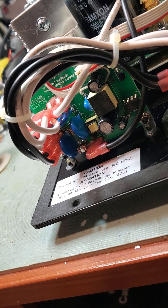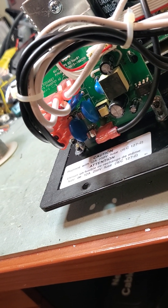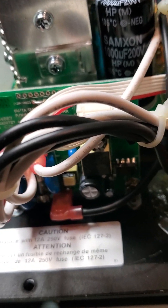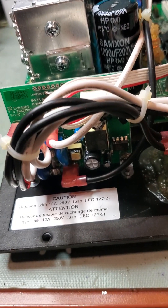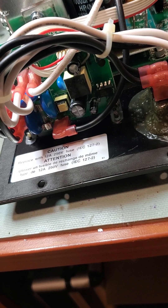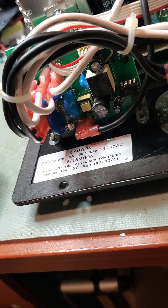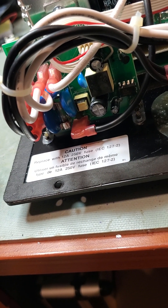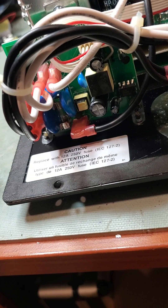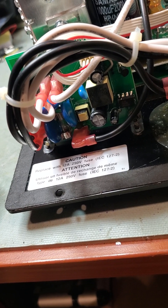I'm not exactly sure why — looking at the datasheet it should work with the 220 that was there before. But anyways, that was my fix. I don't know if others will experience the same issue, but you should give that a try. Just make sure you check the voltage off this board before doing any other work, because it may just be this board and the six-volt supply. I hope this helps.